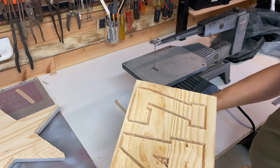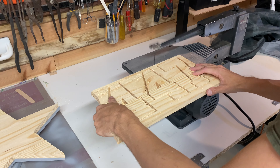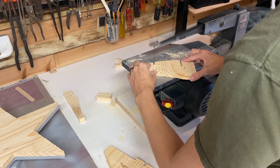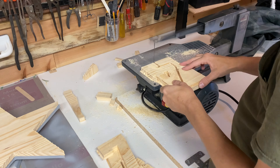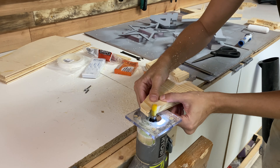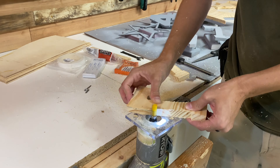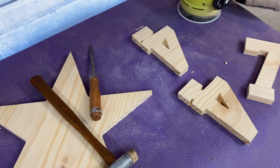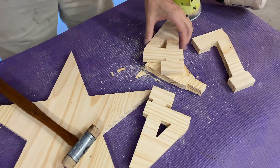This material is about a quarter of an inch thicker than the MDF I was using before, so I didn't cut it all the way through — I just left the settings the same, and then I cut it out using my circular saw and a scroll saw, and then used the flush trim bit on the router to get everything the same length on the edges, so everything was nice and smooth. After cleaning up the inside corners with a chisel, I sanded everything down again.